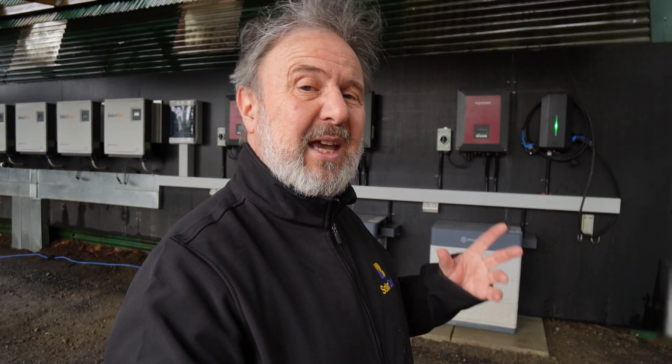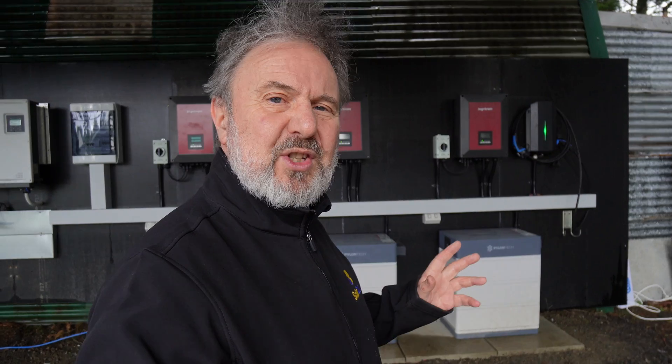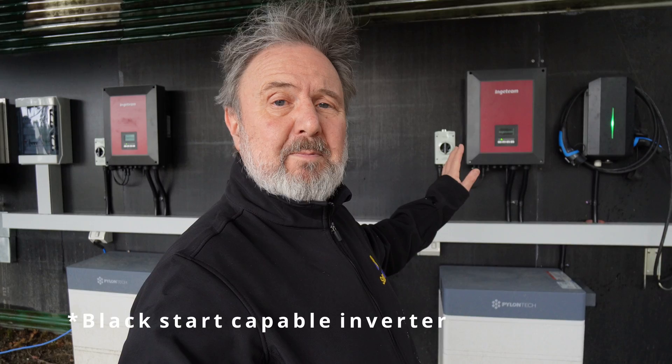This little system could actually have about 40 to 45 kilowatts of solar connected to it, which seems ridiculous for a relatively small system. But if your objective is to use only renewable energy, and solar panels are becoming so cheap, why not use as much solar as you can to offset all daytime consumption and ensure a full battery every day? It almost makes having a backup generator optional. Some days won't be perfectly sunny and you will run out of power — it's a design decision — but going without generator backup is becoming more popular than I'd have expected.